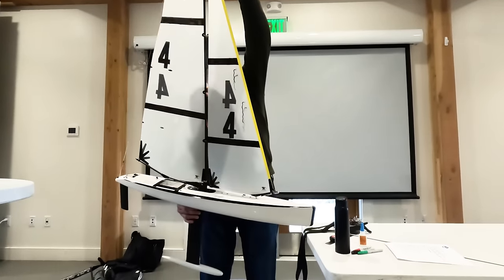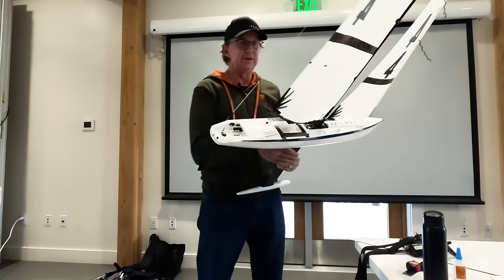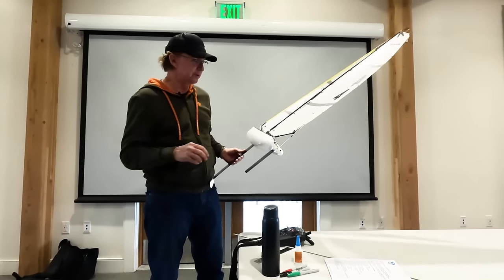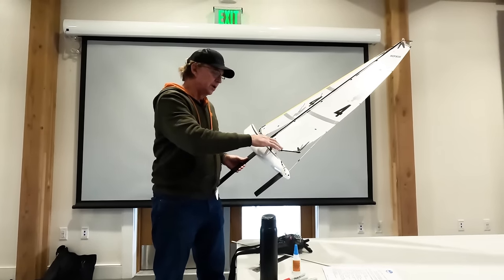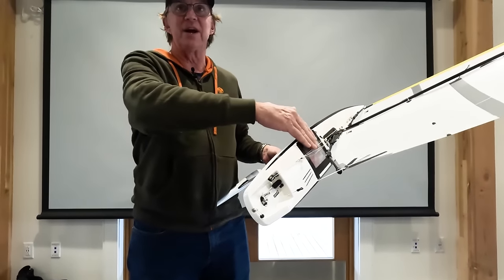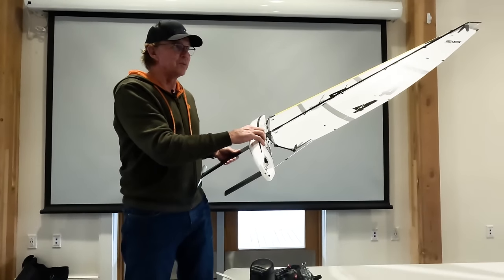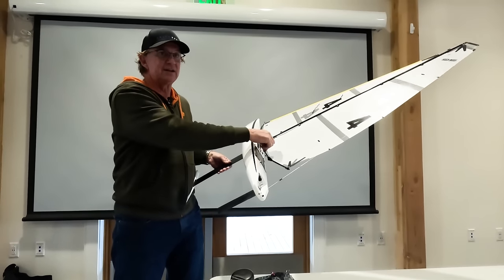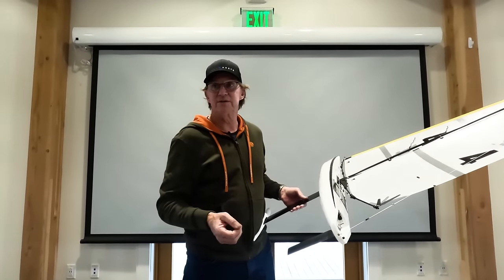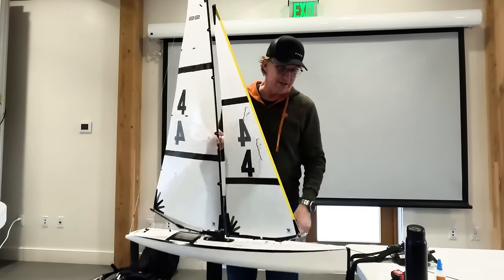Another trick that somebody, I think in Florida, told me at one of these regattas is how to tape your hatch. Another way to keep water out. I can't take credit for a lot of these things because I think it's pure insanity that somebody ever thought it through this much. But they start at the back. They put the cross piece of tape on the back first, and then work your way forward. And the final one is on the front, because you're kind of creating a ramp for the water to go up and over versus a scoop. The water will find any little crevice. So you tape the back first, tape the side second, and tape the front third. And when I started doing that, it probably wasn't coincidental that I haven't had any water since then either. Fun little fact. Again, I didn't think of that. I think it's insane that somebody actually did.